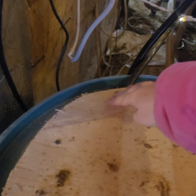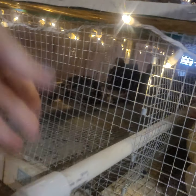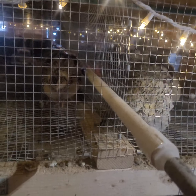The pump is inside and it's plumbed into this black tubing — this is half-inch vinyl pond tubing. It comes in here and runs across the top. I found the easiest way was to start at the bottom; otherwise the water drops too fast through the top ones and sometimes you end up with air bubbles. So I start at the bottom and go straight back through — this is an eight-foot length. I have two horizontal frost-free poultry nipples in each cage, and there are four cages per tier.